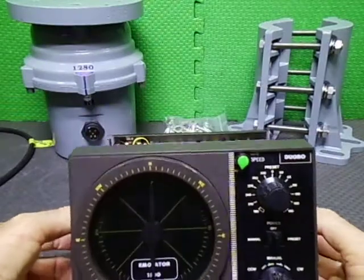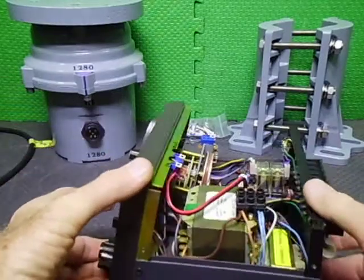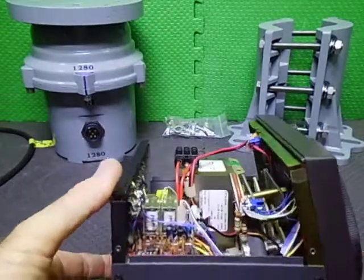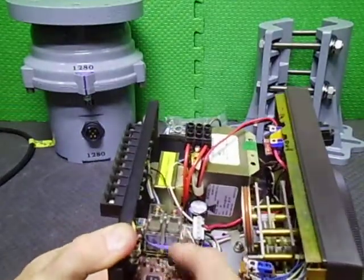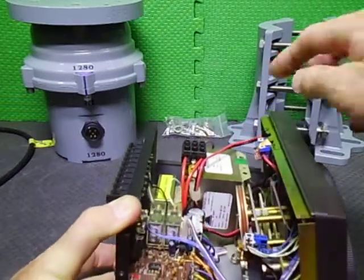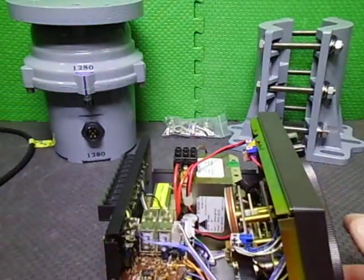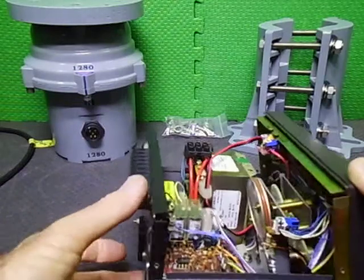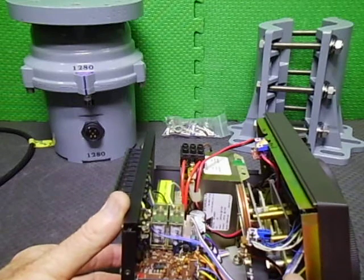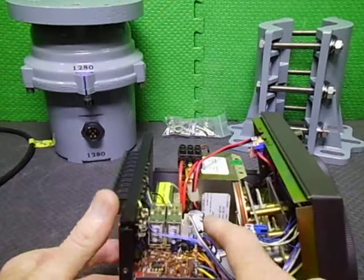It's just been fully rebuilt to accommodate the 1280 rotator. There's the wiring up in here running off into two three-way terminals. It goes to the actual direction switch. I changed the direction switch around — it used to run direct, but it was a bit problematic to get working for the DC, being the fact that I couldn't double-stack the micro switches. So I've actually remoted the direction switch to key in the relays.